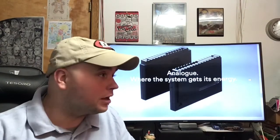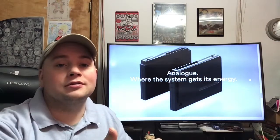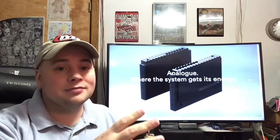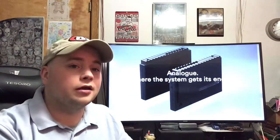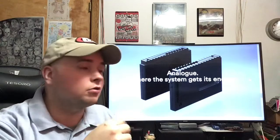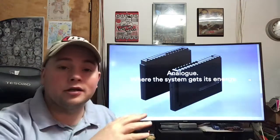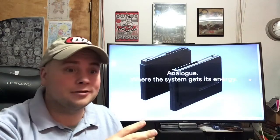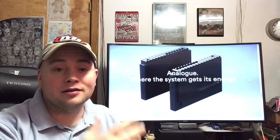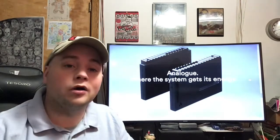I mean, it could happen with brand new capacitors that you get today. After they get a little bit of age on them, I would say they could also deteriorate and start leaking as well. So, that's the thing. I mean, it happens. Some people like to install through-hole capacitors on the surface mount, but I've seen those leak as well. Once they get some age on them, they do leak too. So this will probably be designed pretty nicely. I just don't want to make the man who designed the original Turbo Graphics Duo, the NEC Duo, be upset with me, because I do realize that it is a component issue from the time. I mean, capacitors just leak. I don't know if they're designed better nowadays where they don't leak as much, but I would say they still do because essentially they're still electrolyte and everything else. So I would say they leak as well after some age.